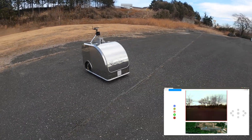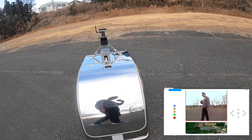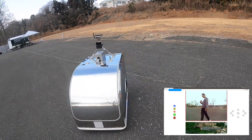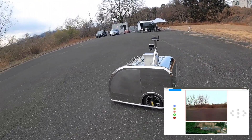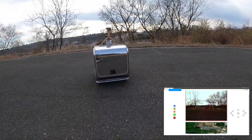Once a human or object comes in front, the robot will stop and try to find an open space, then continue to go. This is a bendy-ruler avoidance behavior, but if we just want it to stop, we can use simple avoidance only.